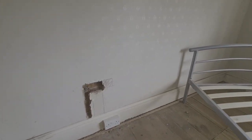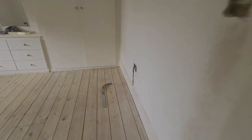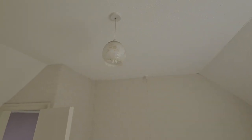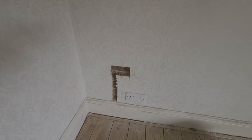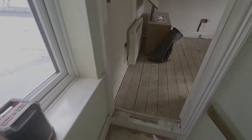I did a bit of stitch drilling and used the Fein on another, and just went straight through with the SDS on another - so you can see a few different techniques. The brick here is pretty soft, and the plaster is a nice depth as well, so it's pretty straightforward to chase out. There's a light switch here - going to be a bit of a challenge with the tight roof pitch not giving a lot of space. These last two sockets here are chased out nice and neat. You don't want to blow out any unnecessary wall because you're making work for yourself afterwards, so it's worth spending a bit of time to get as neat a job as you can.